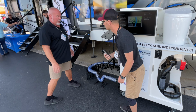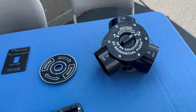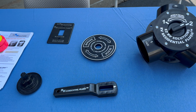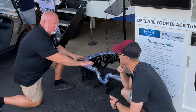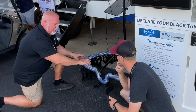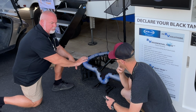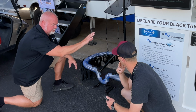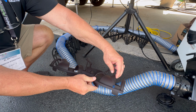So all of our products are made out of ABS plastic. And the advantage of ABS plastic is that it will not crack. You can bend it. If you use PVC, PVC can crack. It actually dries out over time, makes it more prone to crack. ABS does not. So it's a more impervious plastic material, and that is why we use it for all of our plumbing components, which RVIA to code, you have to have black ABS as far as the plumbing goes.